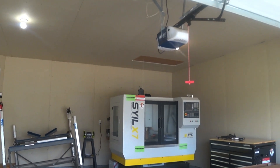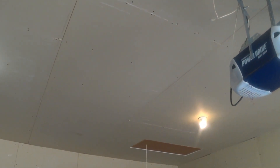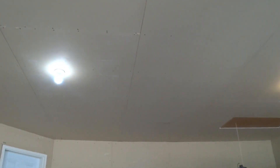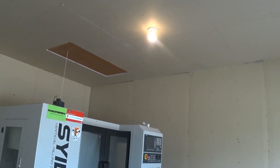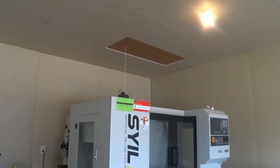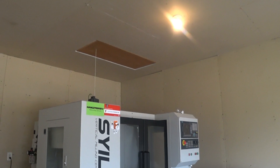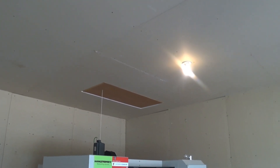Other projects I'm going to work on: the lighting in this garage is terrible — the only lighting is these two light bulbs, not nearly bright enough to work. I'll need to install a full lighting system up top. Also, because it gets really cold here — not uncommon to push negative 20 Fahrenheit, about negative 30 Celsius — I'm going to peel off the sheetrock and make sure the insulation is up to snuff. I'm also putting up a heater in that corner to keep this place at least 50 degrees all winter long.